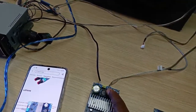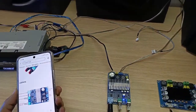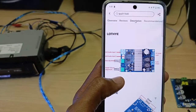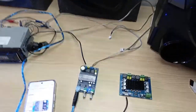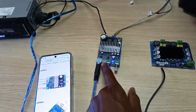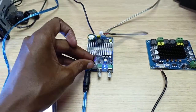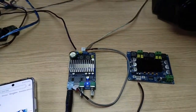You can bridge two 6-ohm subwoofers to get a total of 3 ohms, or you can bridge two 8-ohm speakers to get 4 ohms. So the minimum impedance is 3 ohms. These are the audio ins. By the way, this thing came with two knobs as well as a cable to connect the audio, just like the other board. Actually, this is that cable. In the future I'm planning to use this cable to provide music directly from here, but I'll do that in another video.